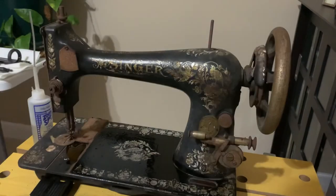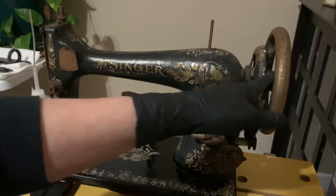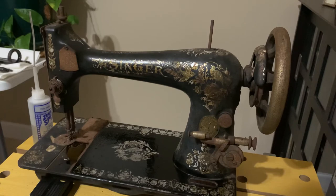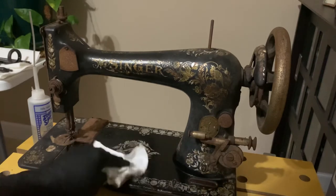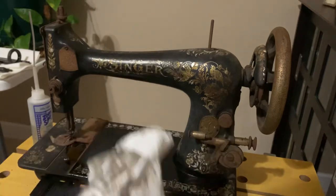It'll also help me find where I need to concentrate my efforts — where it's locked up. Sometimes just a good oil bath and cleaning some of the areas inside the machine underneath, around the hand wheel, and opening up the plates on the side and back and getting some oil down there — a lot of times you can free a machine up. Surface rust or old grease can just lock it up. So I just take my time with it, work it over several days, let the oil soak a little bit, and then real gently do little circular motions with very light pressure. You can see that'll go on for several days.